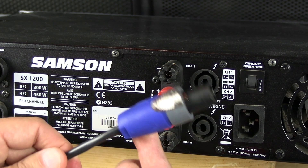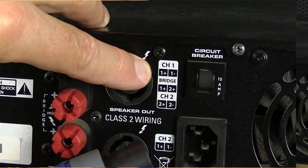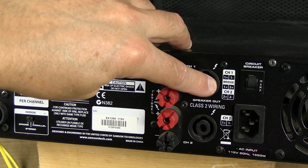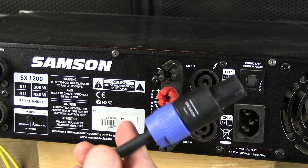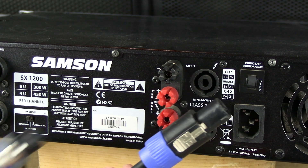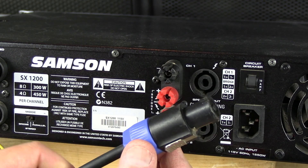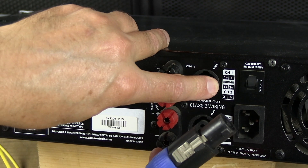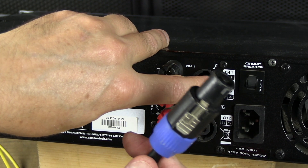In regular stereo mode, you would use a two-pole connector and go to the diagram using one plus and one minus. But in bridge mode, they want you to put the two wires on one plus and two plus. In order to do that, you need a four-pole connector. This is a Neutrik four-pole — it's a little bit bigger and has four poles. You would use one plus and two plus on this connector and then plug it in.